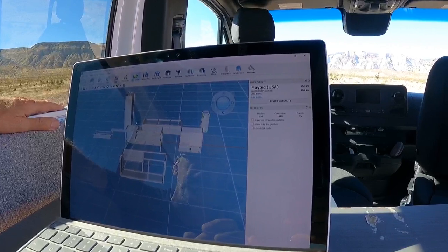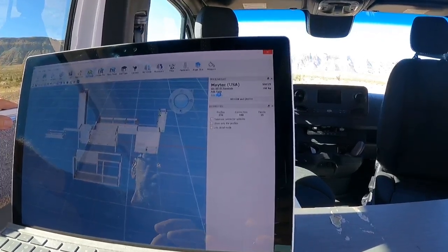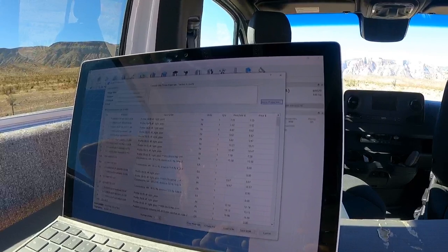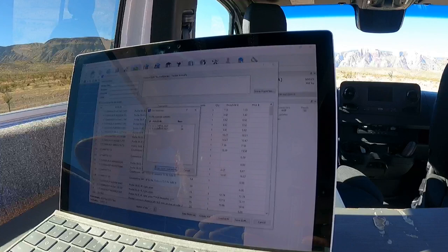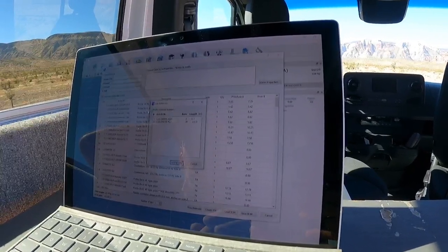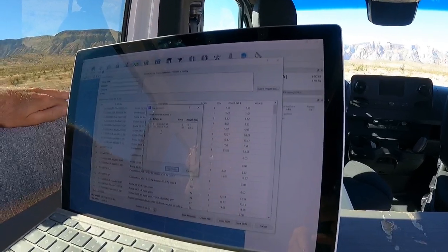At this point you can go in here and edit the build material — this will pop up and tell you everything that you need. I go down to the raw material, which just shows the profile pieces. One of my bars is a 40/40, which is not correct, but anyway it gives you what you need. So 116 meters of 80/20 — this is in meters — so then I know how much I need to order. That gives me the raw material, which is really nice.